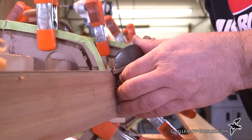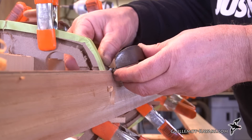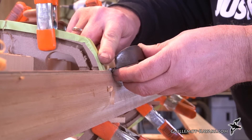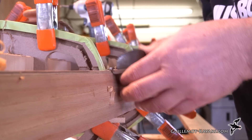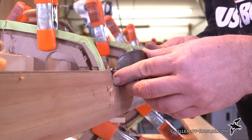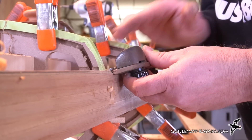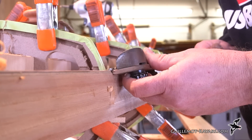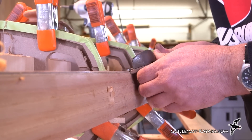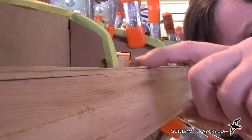I'm holding this rabbet plane at about 90 degrees to the existing strip. When I come back with the robo-bevel, I'll end up beveling it relative to the form above it. Here I want to under-bevel so I don't over-bevel. So either 90 degrees to the existing strip or more towards horizontal. One thing nice about these side rabbet planes is the face of the whole tool is parallel to the cut plane you're creating, so it's easy to keep track of exactly what angle you're at. When you're done with one spot, move on — find the next high spot and deal with that.